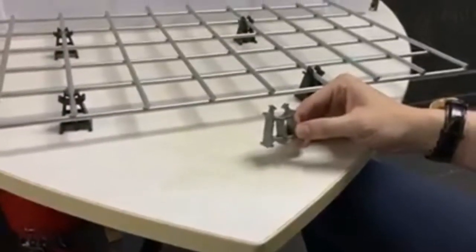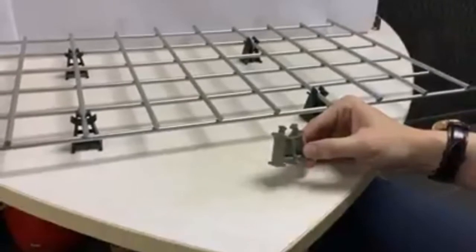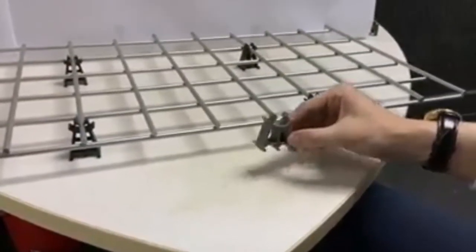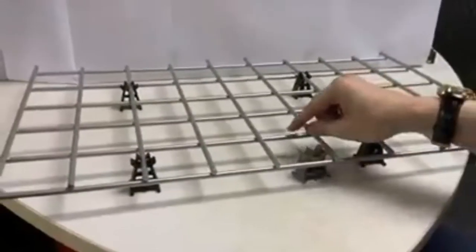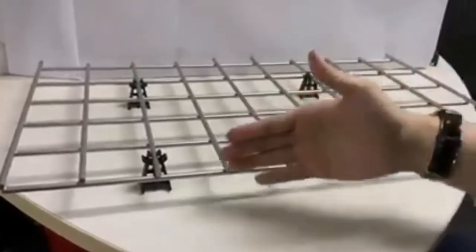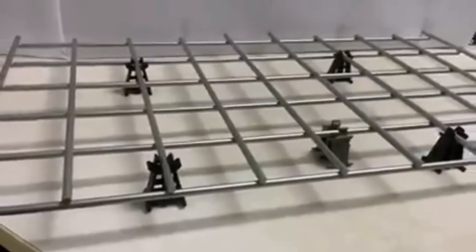This is a heavy-duty plastic chair. This is generally used in slabs and beams. It is used to replace concrete spacers as it has a concrete strength of about grade 40, and this is used in first layer. Application method is easy. You slot it in to the bars in between and you just clip it in, and this will give you a nice height of either 1 inch or 2 inches.